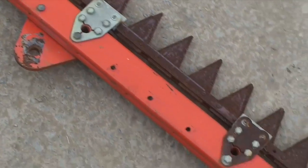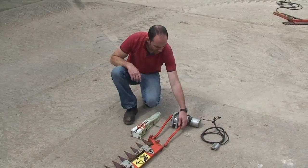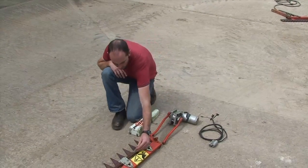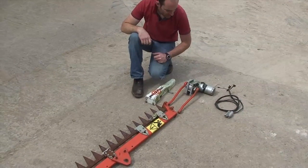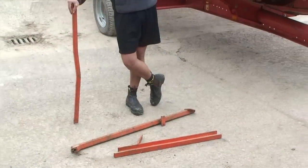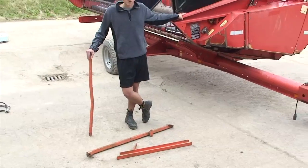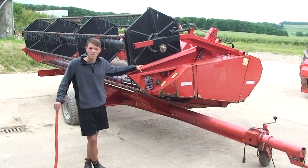You can see it's a pretty simple setup. You've got an electric motor that drives these two conrods, which connect up to the knife here to reciprocate and give the cutting effect — it's not rocket science. We've also got this assorted steelwork left over from the old side knife, which somehow we've got to get grafted onto here to fit this new Massey Ferguson combine.